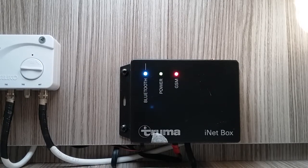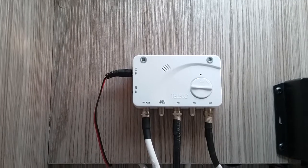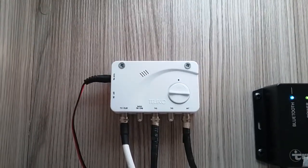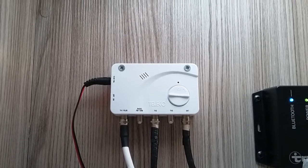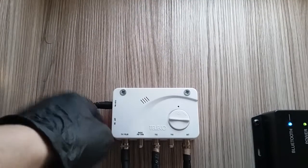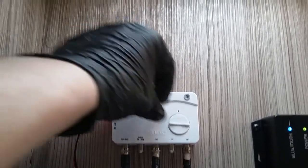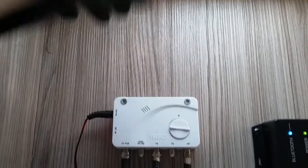Whilst we are also in here, we have the digital amplifier for the television aerial on the roof. These particular aerials do not require any masts putting up or down. All we need to do is make sure that we're flicked on and we can control the boost just here — the majority of the time you need it virtually set to maximum.